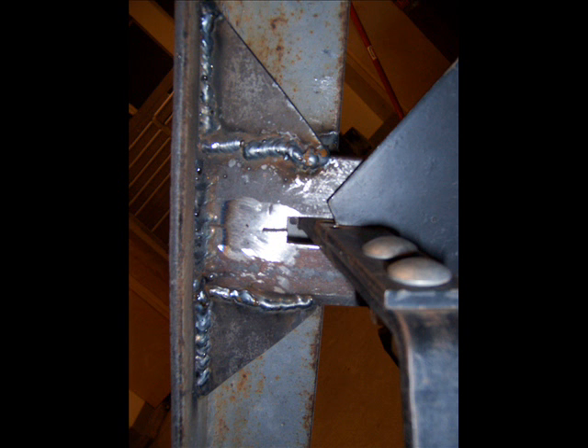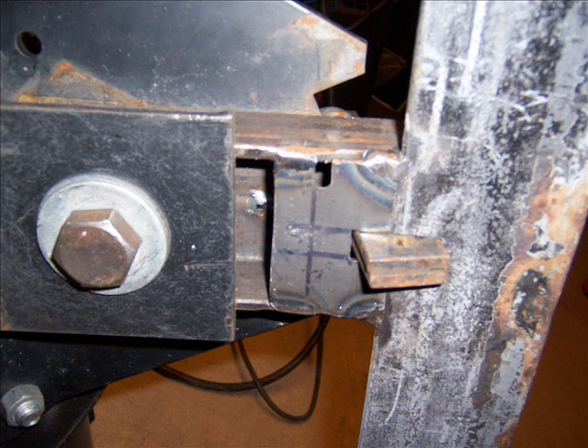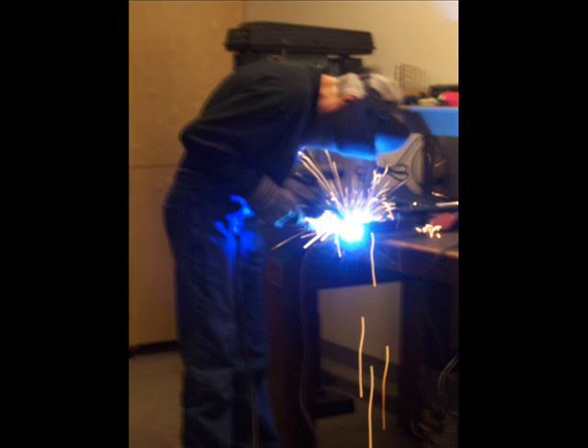The next thing I did was build the snowplow blade mount out of two pieces of angle iron to create a channel. I filed the grooves in this angle iron before I welded these things together — both top, and there's no groove in the bottom. The bottom is just a piece of 16-gauge so that the blade pivot would tilt back and forth in it. Here's me welding that piece — you can see this isn't galvanized, so it welds a little easier and nicer.